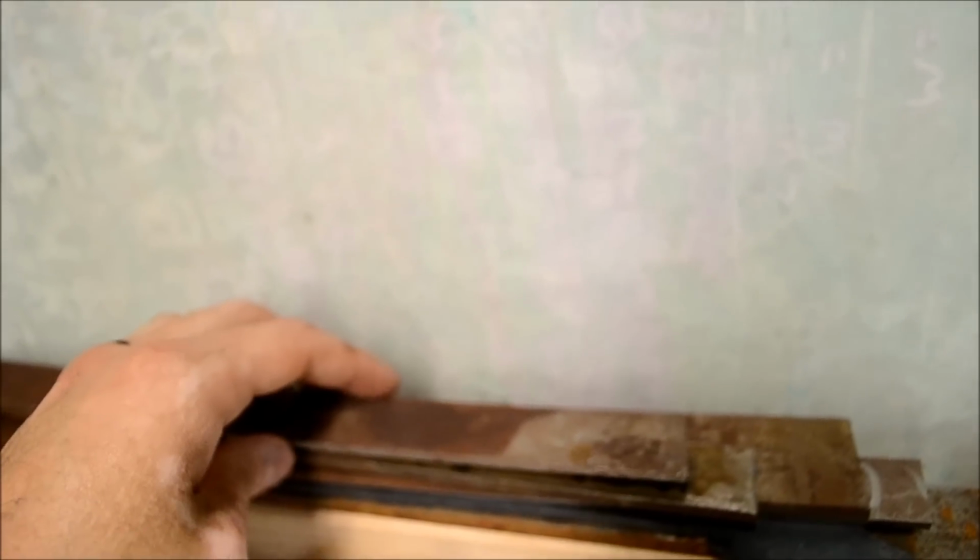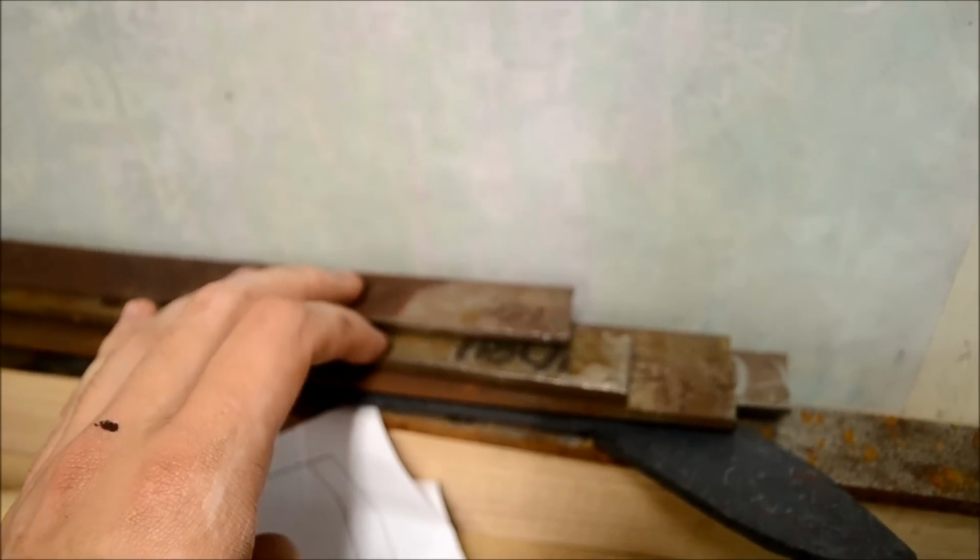So I want to talk about the steel choice for these blades. Those blades are 1095, and you want a steel that's going to harden quickly, or a shallow hardening steel, like 1095 or maybe W2, W1, and I've used 80CrV2, and I got a nice Hamon out of that. But something like 1095 or W2 are going to give the best results for a Hamon. I've done it in 1084, but it's not as striking as the 1095 stuff is.